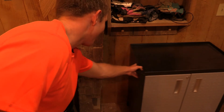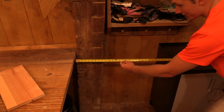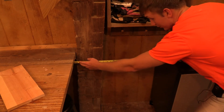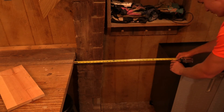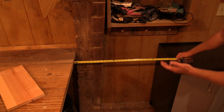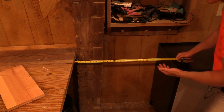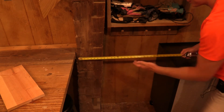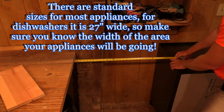So let's take this space right here. What you're going to do is go to the edge of where the dishwasher or washer would be and simply push the tape measure against the edge, follow it down, and find your numbers. Right now I'm looking at 29 and a half — same deal as a board except you're measuring something that's not there. There's a decent spine on these things so you can push them up straight and they'll keep their form and not crinkle on you.